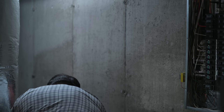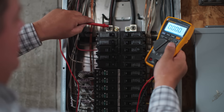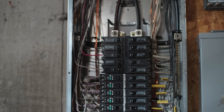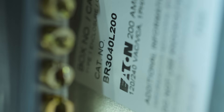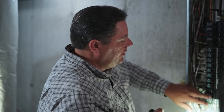You probably don't get to see the inside of that too often. While that non-contact tester is pretty good, they're not foolproof, so I just want to check it with a meter to verify. It's labeled correctly and the power's really off. Now I want to look for a manufacturer's tag that's hopefully in the panel since we didn't have something specific on the cover for what we could do. There's our manufacturer tag — 30/40 — so it's telling us there are 30 spaces available and 40 circuits. That means it's acceptable to install a certain number of tandems, which is great news. So we can move a few of these around, make room for that new breaker, and install the charger without having to install an additional subpanel.